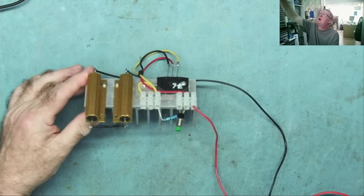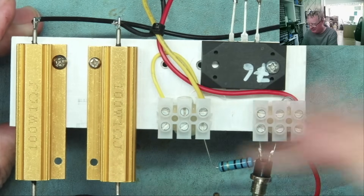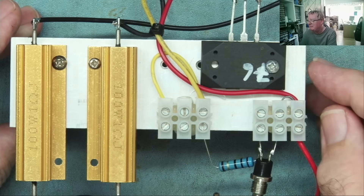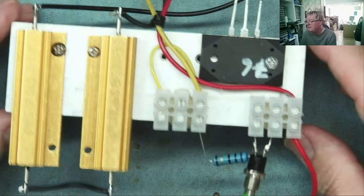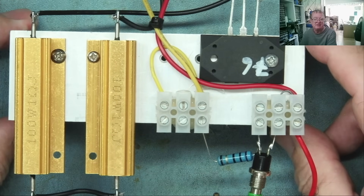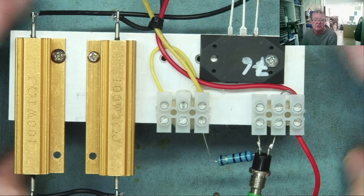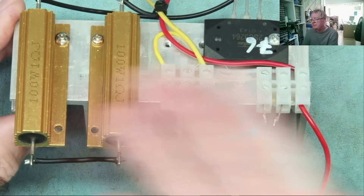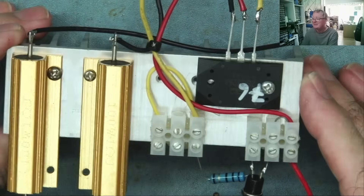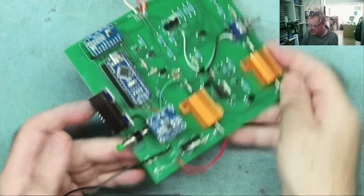This is the constant collector current gain tester. This measures the gain of bipolar transistors, N or P type. This is a very, very simple device, and in actual fact it doesn't need a PCB. You guys have seen me using this with batches of transistors, getting very accurately grouped pairs or fours of the same gain — you need that in some sort of circuit. It's built just using terminal blocks, a metal heatsink, and a couple of resistors. I'll link that one in the video description.